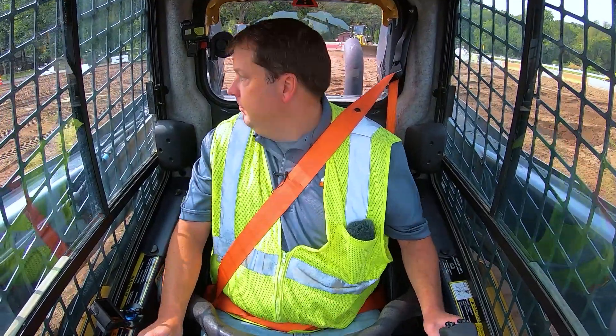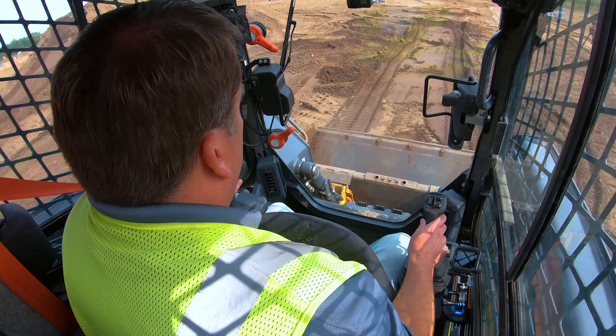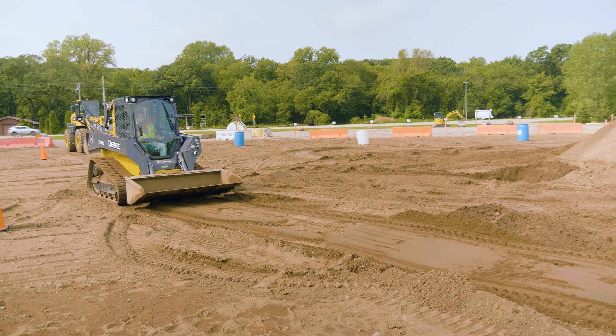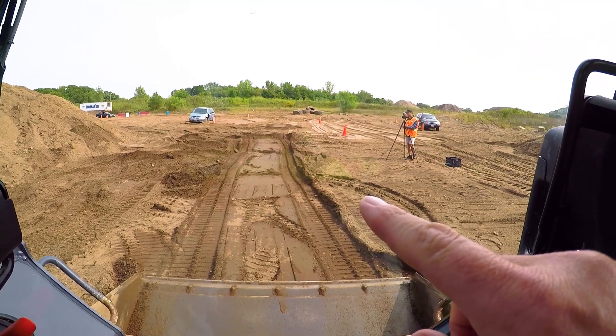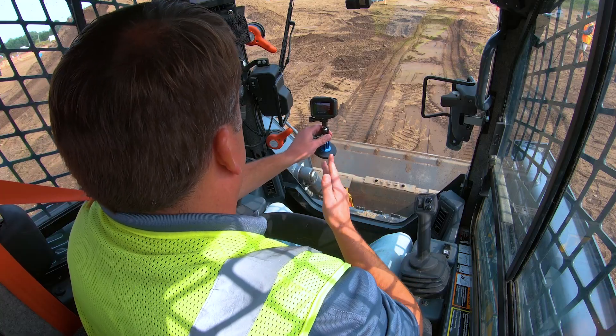Always watching where you're backing. So as I see that plane in front of me now, I can see - we're using a handheld camera so you might not see the best - but I can see I've got piles of material there and some holes right there. You're constantly assessing where you're going and trying to get material into those holes.